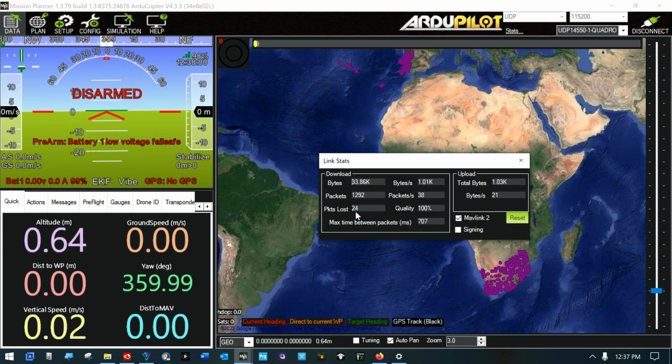And you see there is increasing packet loss. That just means they're retransmitted. They're not totally lost. They're partially received and therefore declared lost, requested to be retransmitted and received well. If the second time they lose part of the transmission, they declare it lost again, bump this number by one and go again. So this is pretty high too. I don't like that getting down in the 800s.